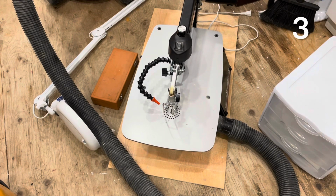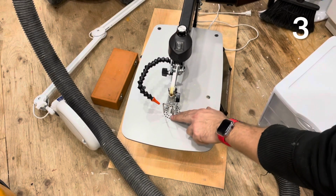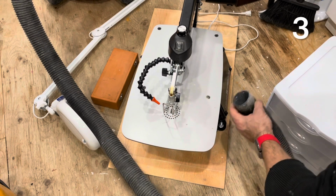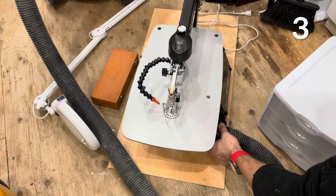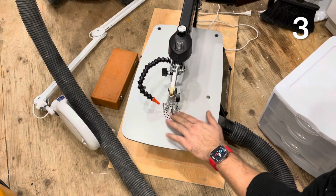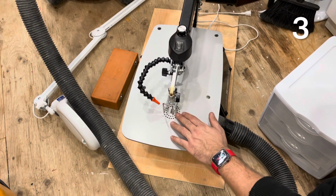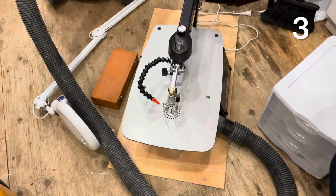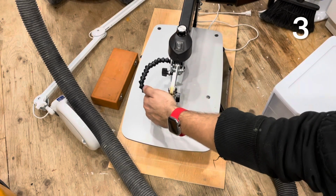And this scroll saw is pretty awesome. It's the first one I've seen with the holes around where the blade is. And when you hook up the vacuum to underneath here, it will actually have a vacuum suction on these, and then all your debris and dust gets sucked out through to the vacuum, and you're good to go. Obviously you have your nozzle blower and whatnot.